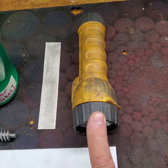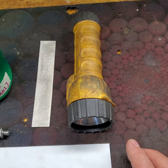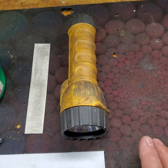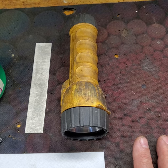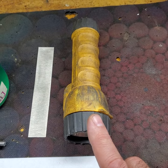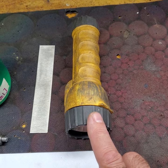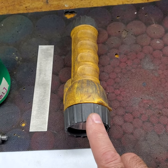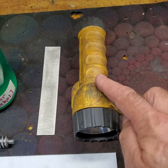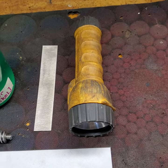You will need a power source. It takes DC voltage to nickel plate. I have a low voltage power supply - I plate with two volts. But you probably have enough power just in the batteries of a flashlight to electroplate. You don't need a fancy power supply. In fact, I nickel plate with two volts and two batteries in this flashlight are three volts - that would easily be enough power to nickel plate.